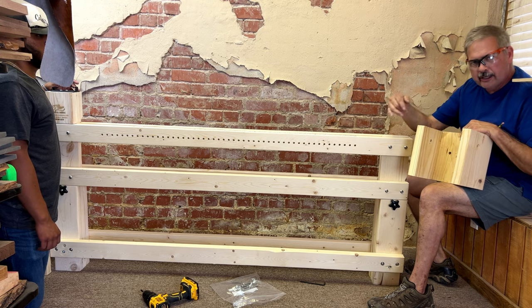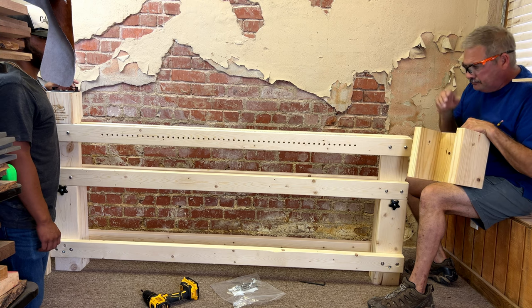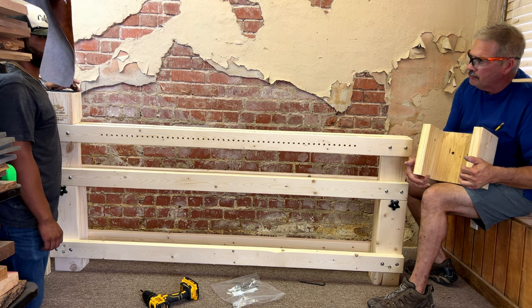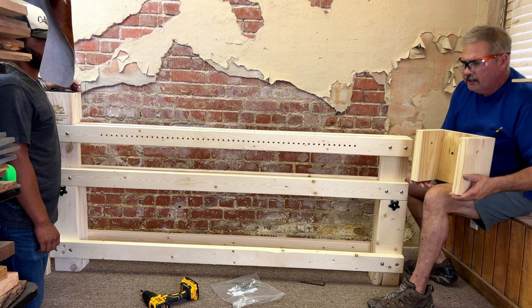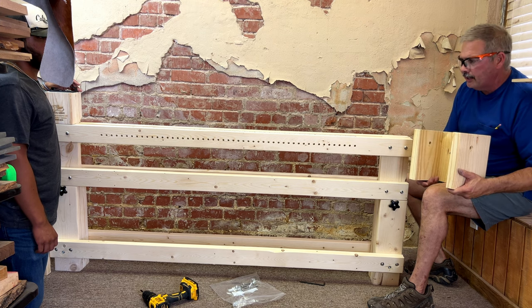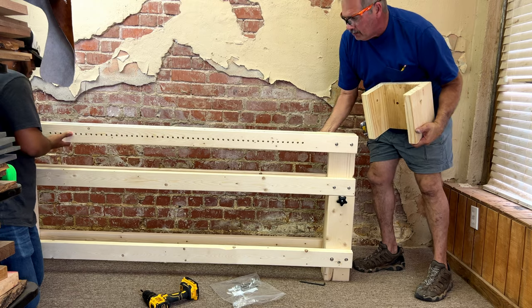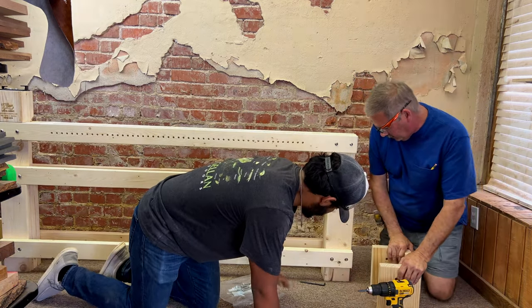We're going to slide this thing down where you can actually just see both of us working together on this one foot. Something you do need to know is the leg only comes up probably 2 inches from the bottom of this foot, so it actually rests on the foot, not the leg itself. You can put a couple of little blocks of 2x4 under here, which will help line it up too if you want to do that. But anyway, we're going to come down here, scoot this thing that way, Marco, where we can both get on it, and we'll put some screws in it here.